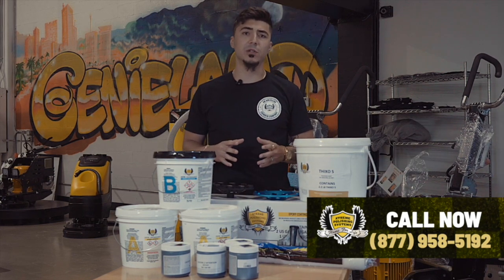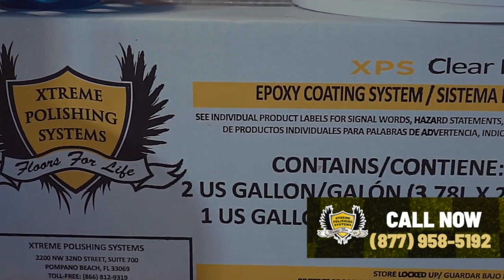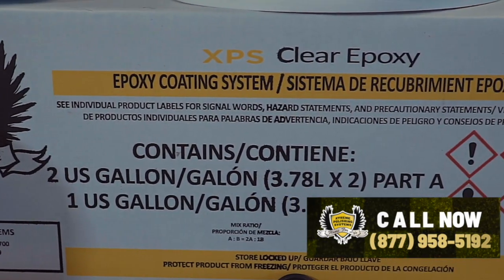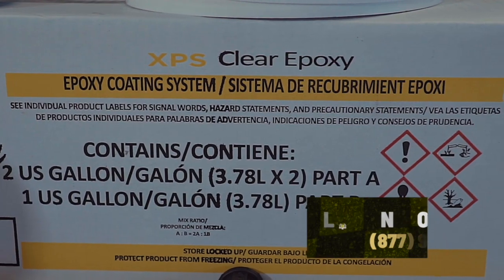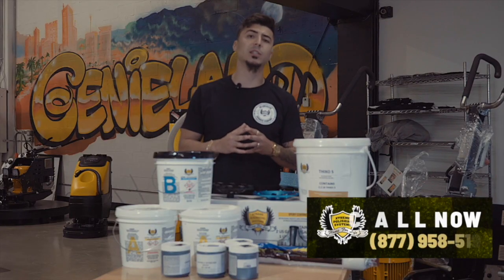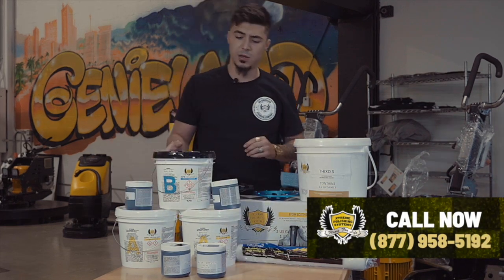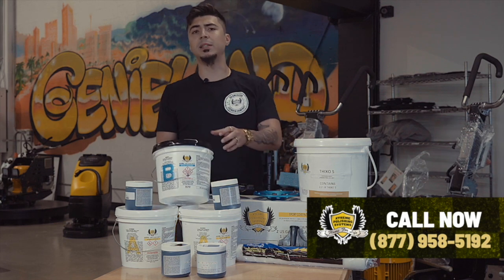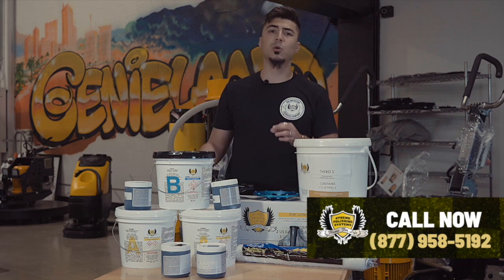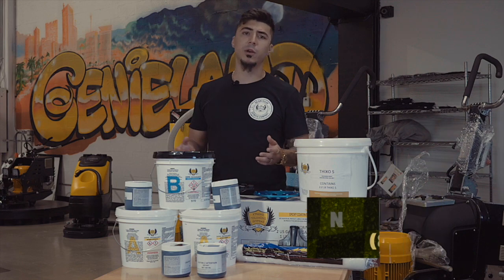You're gonna let that dry for 10 to 12 hours. You're gonna either come back that same night or the morning after, and you're gonna do your final coat. It's only 2 coats on a solid floor. So you're gonna follow the same exact process that you followed on the base coat. You're gonna put your 2 blacks in your 2 A's. You're gonna mix that up. Then you're gonna mix it with your B and you're gonna lay it down the same exact way, 100 square feet a gallon. So there's 3 gallons, you have 300 square foot in a one car garage.